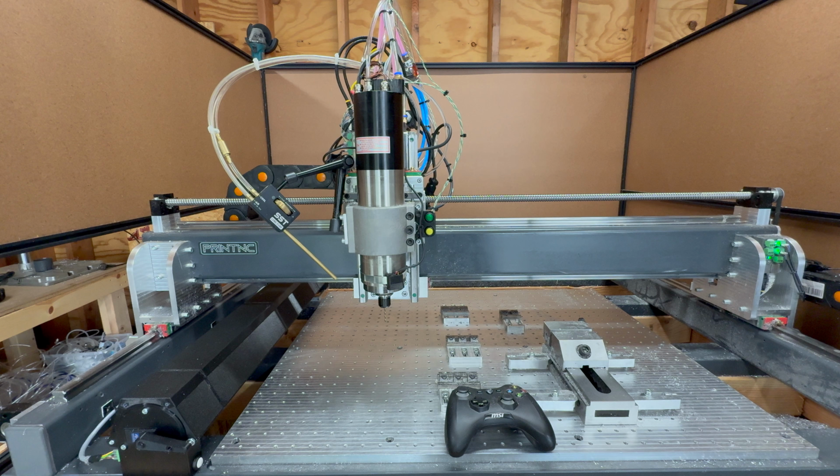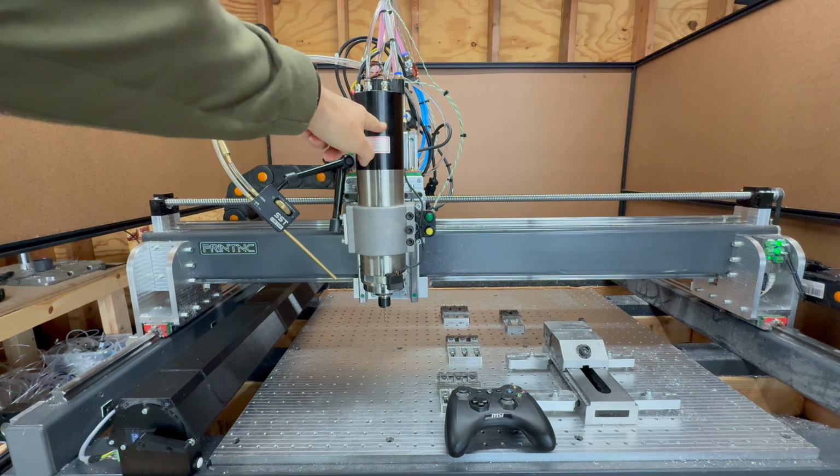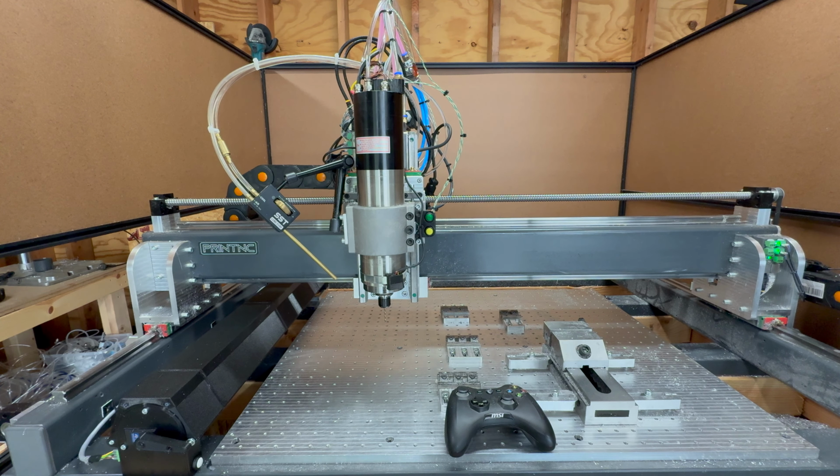But first, one question that I got plenty of times is, why did I ditch the rapid change ATC systems that I had been using the last months? There's no good reason. The rapid change worked great and works great. I just felt for a new toy and a new project, and that's why I decided to get an ATC spindle. After doing some research on the web, I decided for the Jianken JGL80 spindle, 24,000 RPM, ISO 20 tool holders.